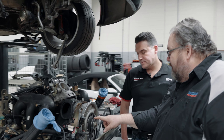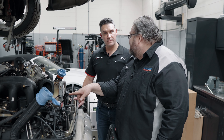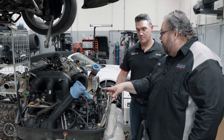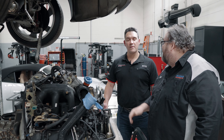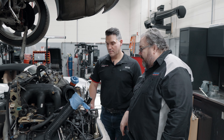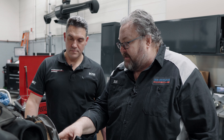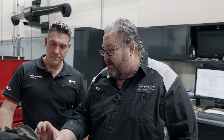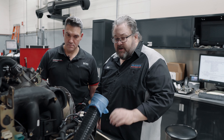One thing that makes me laugh: when Porsche came out with these cars, if the battery got low and people started them, the alternator would go to full field and burn the belt right off — they'd have to get towed. This car does not have the upgraded pulley. The Turbo S has it — it's basically billet, all machined from one piece of metal so it's stronger, doesn't flex as much, and holds better.